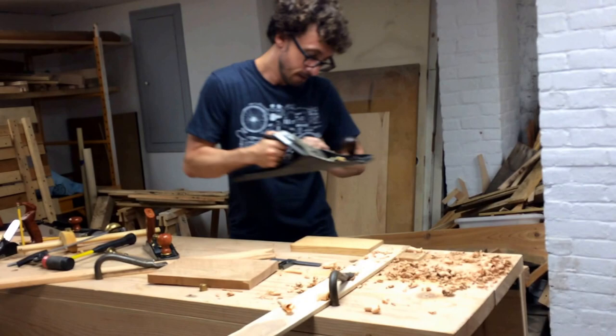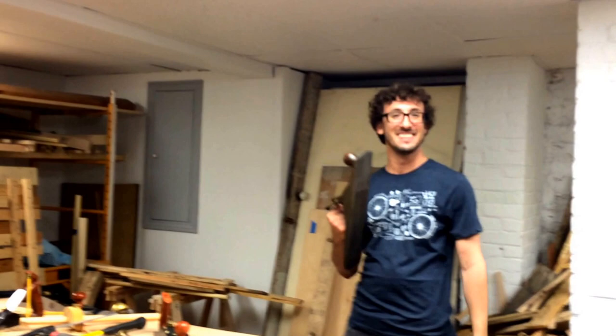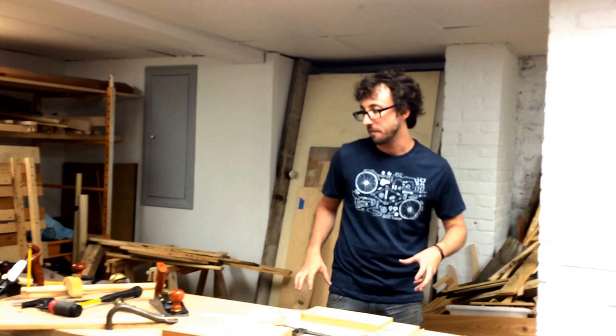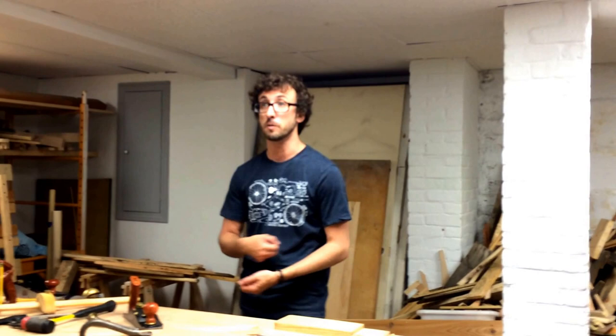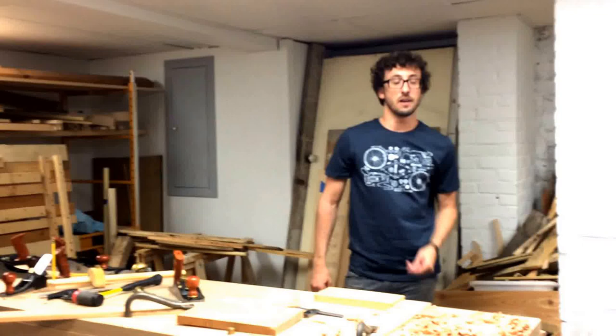Are there any safety concerns that you need to... Yeah, you see me do this. That, never do that. That's about it. Most of the time when you're talking about safety with hand tools, it's with the chisels, because you don't ever want to have your hand behind where you're pressing. You're moving your body. So you'll use things like this, and you'll chisel this way instead of holding it, doing this. That's the biggest no-no.